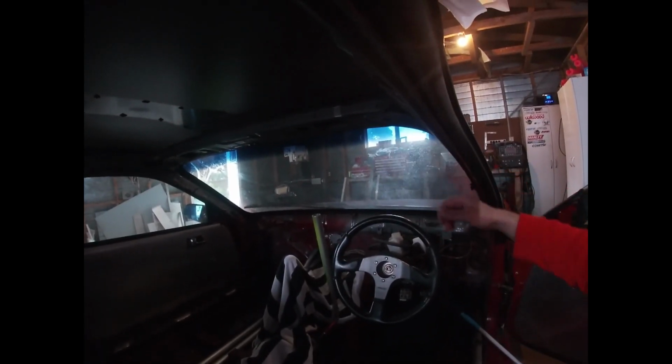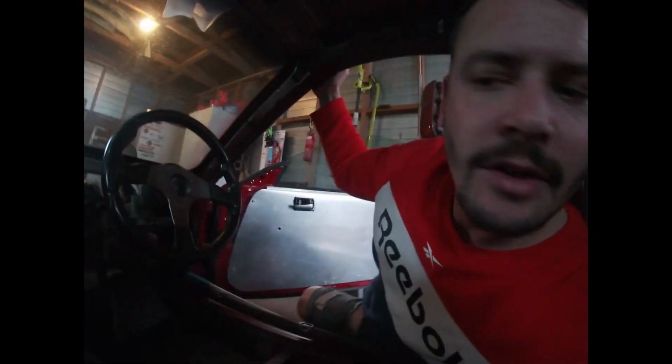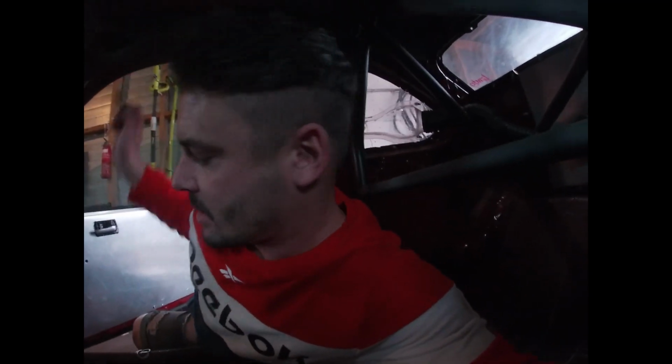So if I can have it not fully welded down this end, I can pull it down, weld around as best as possible, and then put it all back up, do that underneath. And also, I've got to source some 3mm plate too for the stays where they go to the floor, because obviously you have to weld a plate to the floor where the tube bolt welds to. Sorry, I'm all over the place today.